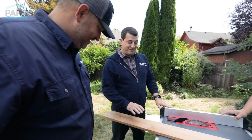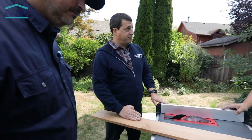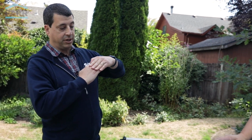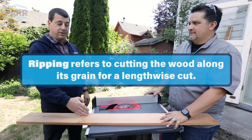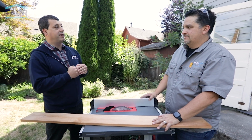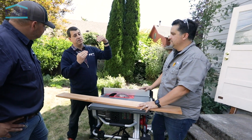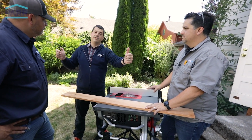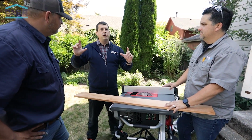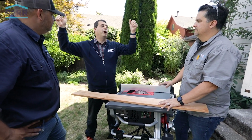But it's typically made out of a nice, solid, stable piece. You don't want to use anything too big. I like to do a 45-degree angle so it has a really solid lock when it goes in. And you can rip one piece right down the middle at your angle so that they correspond perfectly and match when you mount them on the wall. One piece gets screwed to the wall, to studs ideally. And the other piece gets screwed to your object that you're going to hang, and you pop it in place, and you can actually adjust it left to right as much as you need. Easier to get your mounting height just right that way because you're not holding something heavy trying to keep it in place while you're putting it on the wall.